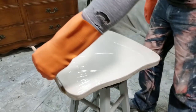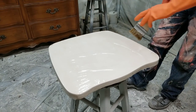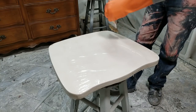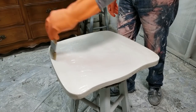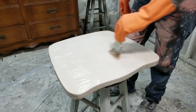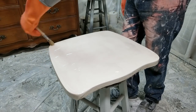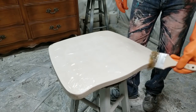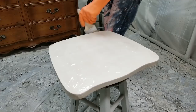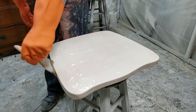So this has to get down, eat through the polyurethane top coat, the paint that's on it, and the original finish that was on it, because whenever I paint stuff, it's not stripped all the way down, of course. So I want it to be able to sit on here for a good 15 or 20 minutes without drying out. So using a crap load of it is the best way to go.